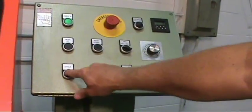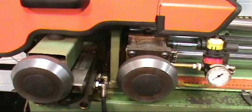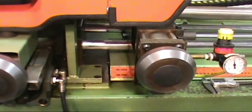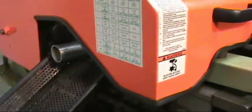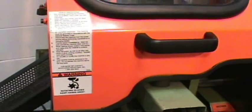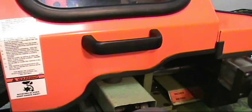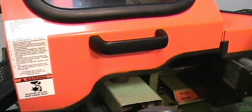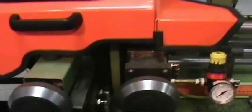Go to where you want it to be, then go to auto. Click cycle. The indexing vise grabs your part, indexes it up to the main vise, and cuts your length. We'll continue to cut the parts until your part length or part count is complete, when it will all shut off.